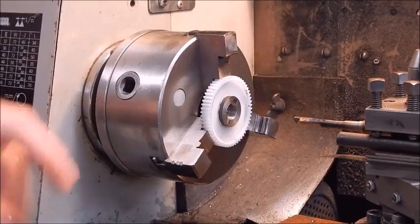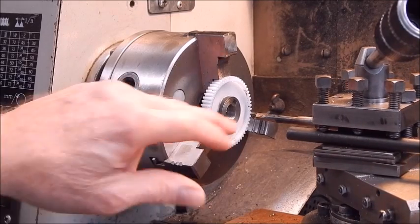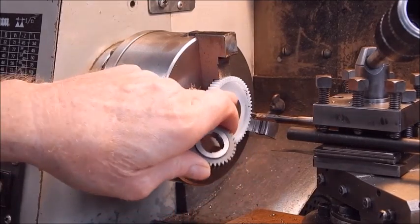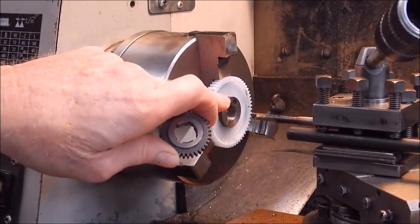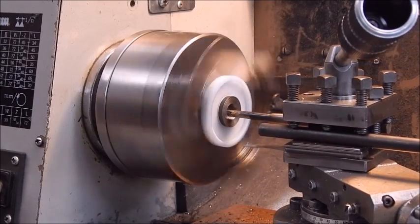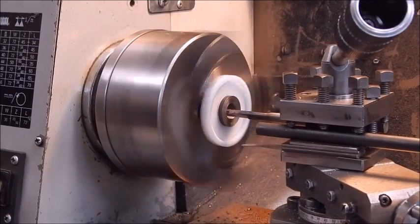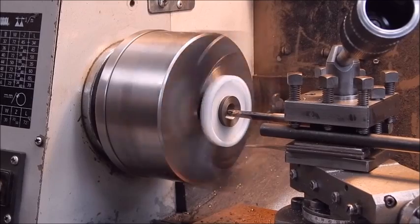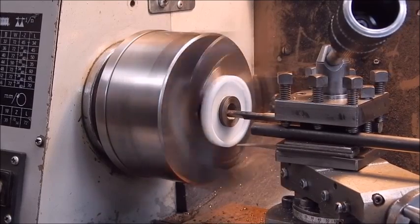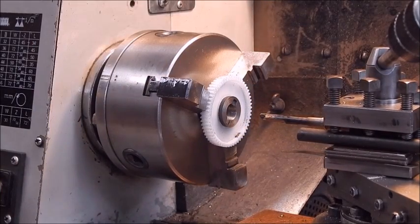Just check your temperature — that's okay. You don't want it getting too hot; just work your way through it. Keep measuring it with some dividers or whatever until you get the same internal dimension as your gear. Certainly you've got to keep that temperature down — if it still gets too hot the whole thing will fall apart. If it gets too warm just put a bit of water on it.